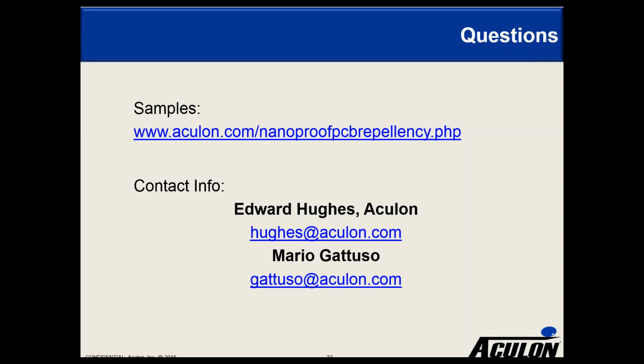How do you advise I test to see if the waterproof coating is good for my part? Well, what we've seen in developing this and working with customers is they have a huge variety of tests, from medical device guys who are worried about splashing of the occasional water or bodily fluid onto their device, to other people that will say they want to do IPX7, to other customers that want even greater, longer periods of immersion and in a variety of solutions. So, as I said during the presentation, you need to determine what performance spec you want, and then connect the board, or turn power on the unit and test against those conditions.